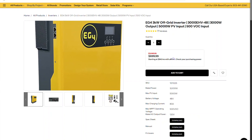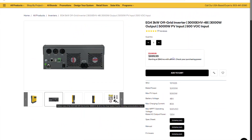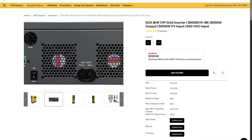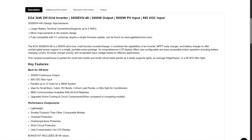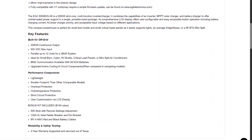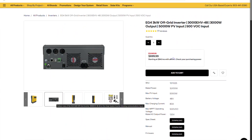We're going to replace the inverter. There are really great options now. This one is from EG4 — I see this company pop up all the time but have never installed one. They seem to be very low price compared to the old-school Outback, Schneider, and SMA options I'm used to. This particular one is a 3kW off-grid inverter, and for 700 bucks it seems worth testing out.